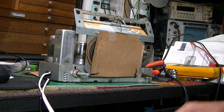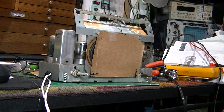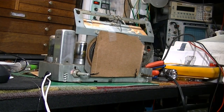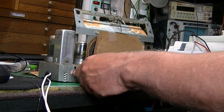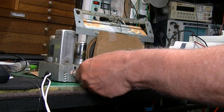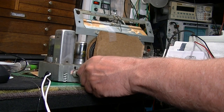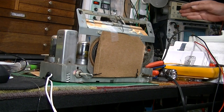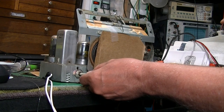Here's the power cord I made up. I'll put this in the transformer, turn this on. I should see around 47 volts - that's just to see the pilot light comes on. I'm hearing hum and I've only got 30 to 46 volts. Turn this down. That's 88 volts - I'm getting a bad hum.